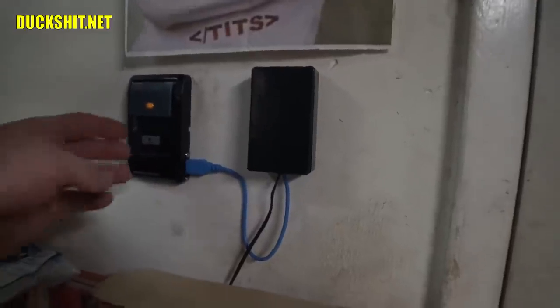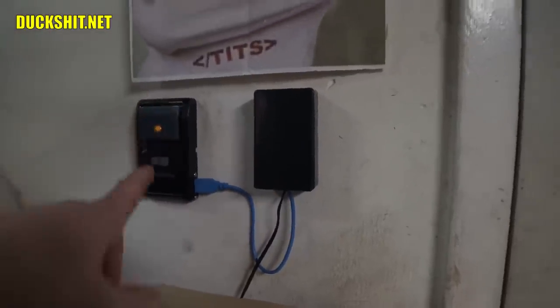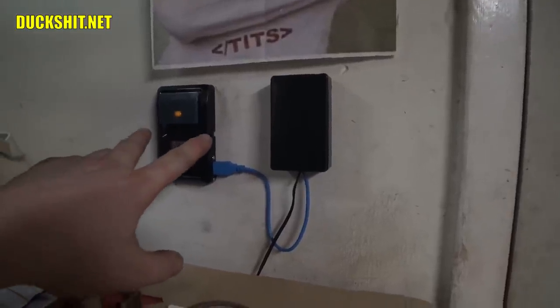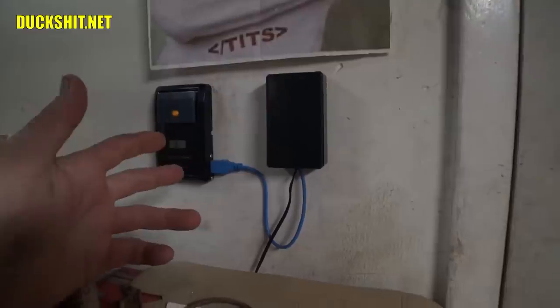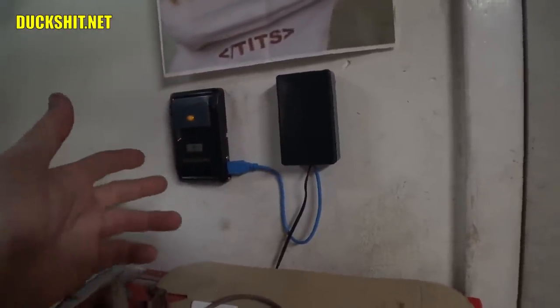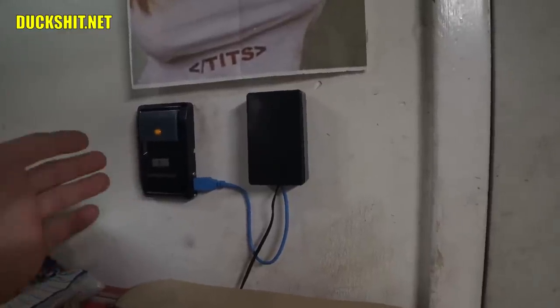Alright, it's really simple how it works. My Chamberlain garage door opener is here, and this little guy has just two wires feeding into it, a positive and a negative, and it produces 12 volts. I tried to get my little Arduino to run off of the 12 volts, but it didn't provide enough current to get the Arduino to even boot up, so that wasn't an option.